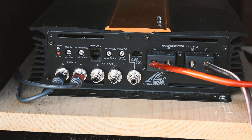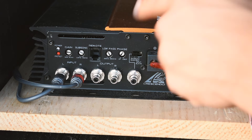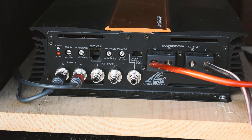Next to that we have a remote — you can link two of these amps together. After that we have our low-pass filter, meaning any frequency below the frequency you pick will be passed through the amp. Mine is set to about 80Hz, which is generally what you want to cross over your subs at. So anything above 80Hz will be eliminated and not come into the amp, and anything below it will be passed through — that's why it's called a low-pass. Finally, phase — I have mine set to zero.